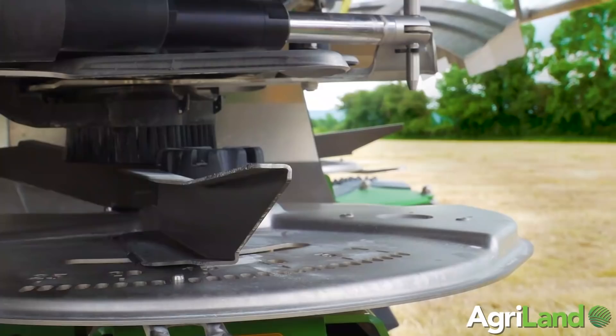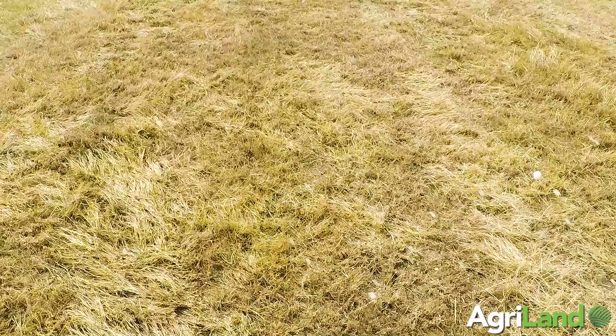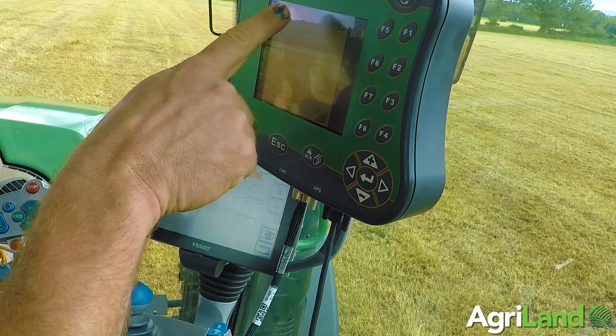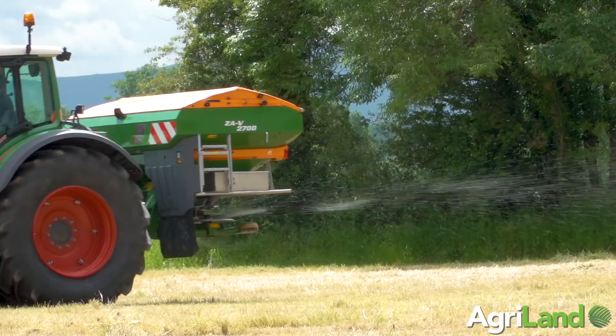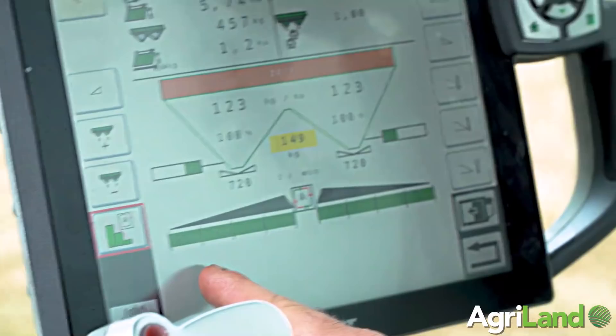Declan also told us about some of the high-tech features on this spreader, which avoid fertilizer overlaps and loss to the field boundary. It uses two-way load cells for monitoring the weight of the machine and a speed sensor from the tractor. The GPS monitors on/off positions — your ins and outs on the headland — and also handles short ground, allowing the rate to be reduced on one side or shutting off one side before the other when a headland is an irregular shape.